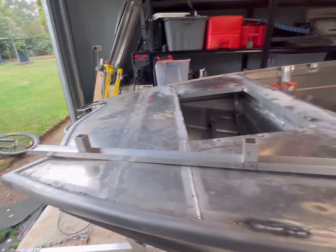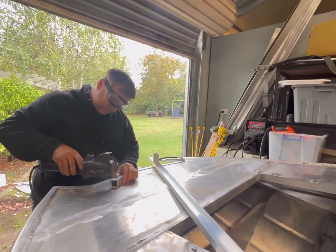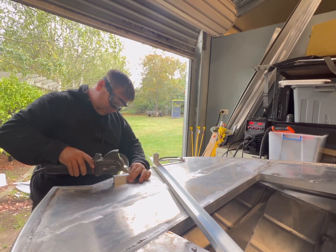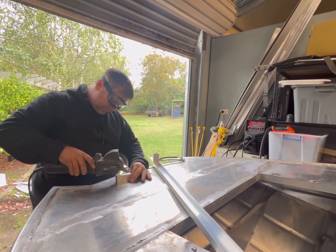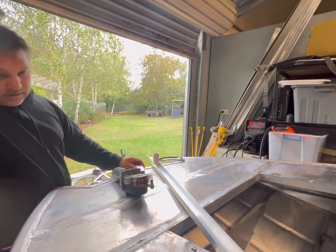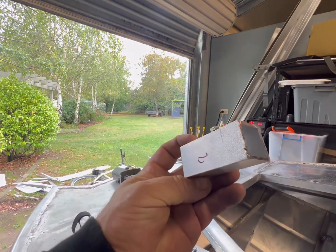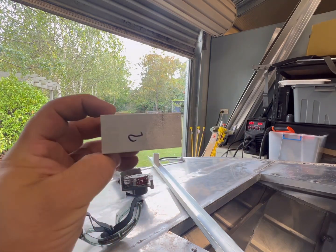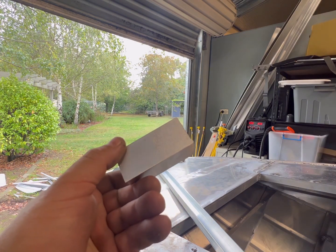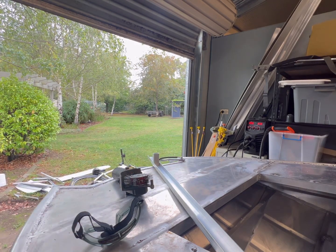And I get the grinder out and clean up all the surfaces in that area. So, if you can see that, it's put a really good, it's like a sandblaster. It's chewed all the shiny surface off and lets the weld grab onto the aluminium really good, because it's got to be clean. So I'll do the rest, we'll start welding.